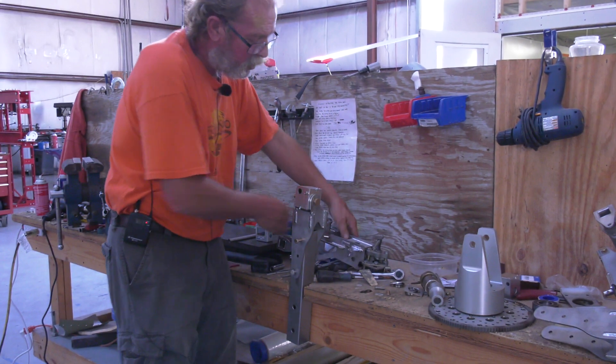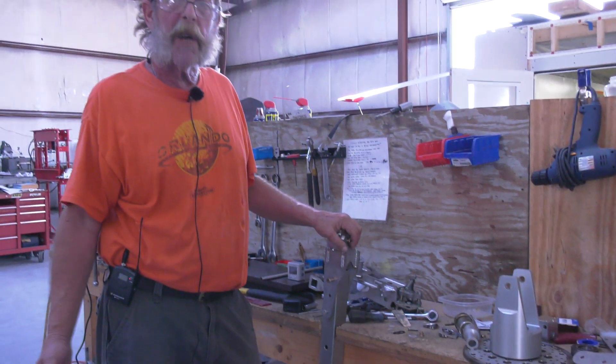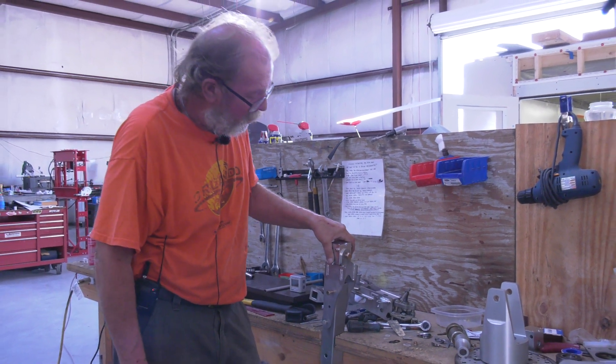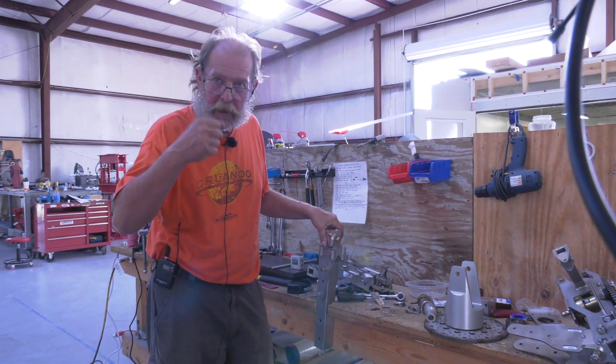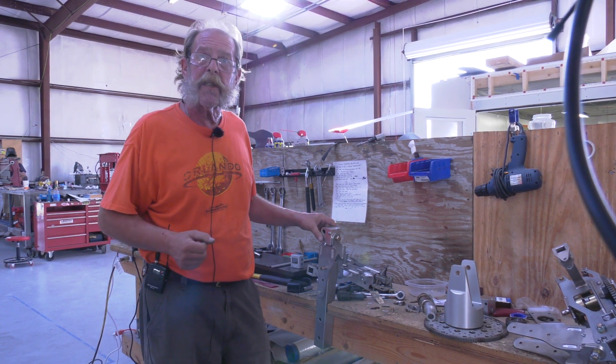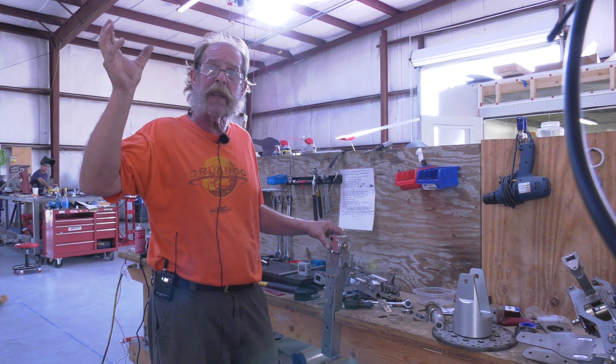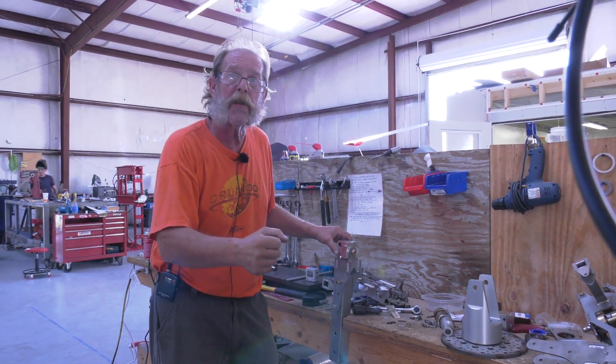If somebody asks me about the torque on these bolts — you cannot torque them too much, or else this whole thing gets stuck and your rotor head would not move. But yes, you do want a slight friction — it takes vibrations out, it catches vibrations on the rotor head and doesn't feed them forward to your stick.